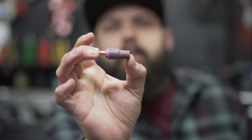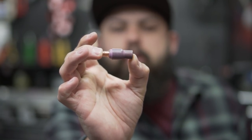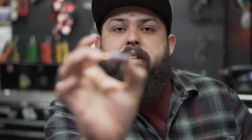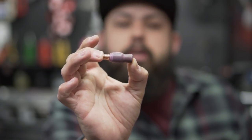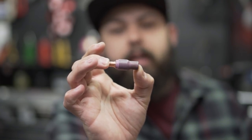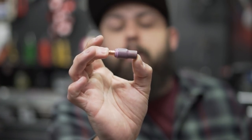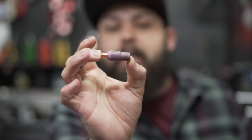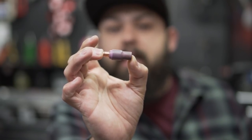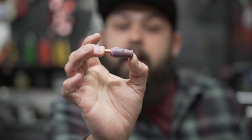Now when you're welding aluminum, depending on where your gas flow is, your arc wants to follow your gas path. So if your arc is puddling all over the place like it would on a reactive metal, your arc is going to kind of arc off of that gas and it's going to give you an extremely choppy oxide cleaning line. So with a cup like this — shooting for aesthetics on an aluminum intercooler for example — number 4, 5, 6 standard cups depending on the application and joint are absolutely fantastic on aluminum and I won't use anything else. I'm not telling you not to use a gas lens on aluminum, I'm just saying this is what works for me.